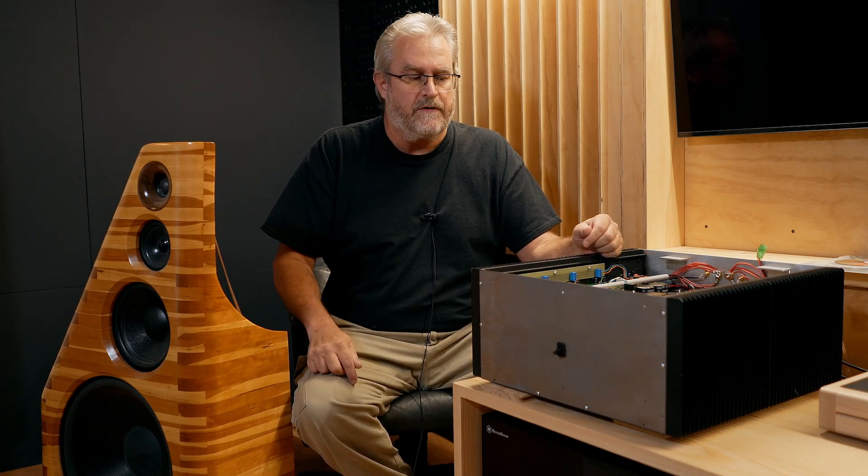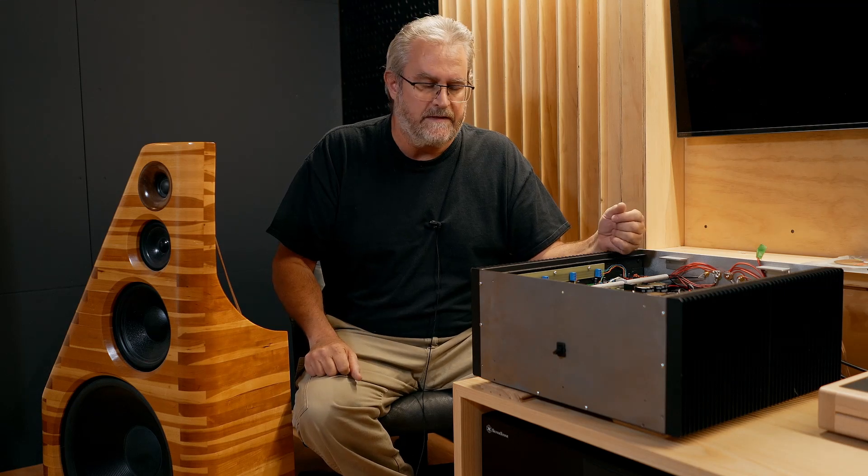In a recent video I talked about making measurements in your room and equalizing your speakers to get the best response and best sound quality possible. I don't have that ability here with a fixed analog crossover, though I could install an equalizer in the computer — something like Equalizer APO. But what I did when working with the mini DSP 4x10 and designing the slopes was to remove all the equalization I had before and just play with the slopes and crossover points to get the best response and sound possible. Take the woofer-to-mid-woofer crossover, for example.